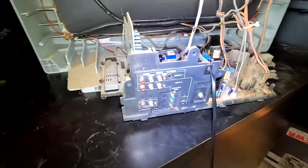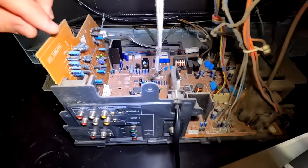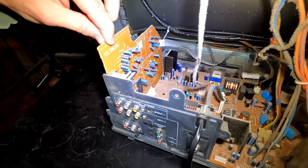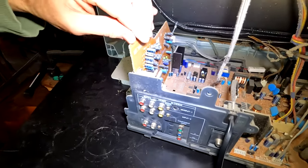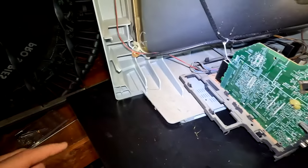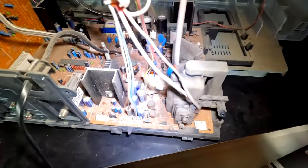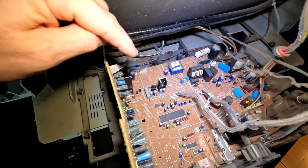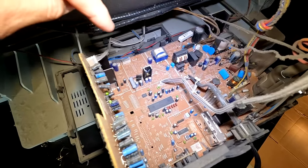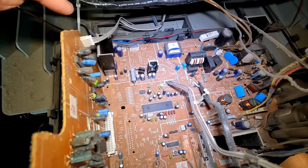This chassis single board there is gonna come out and get serviced. This is the tuner and volume board. It's not going to get recapped. Who cares about that, right? But the other will be recapped down in here. I noticed that this board looks to be pretty simple in design, meaning a lot of these peep points down in here have no hardware in them.